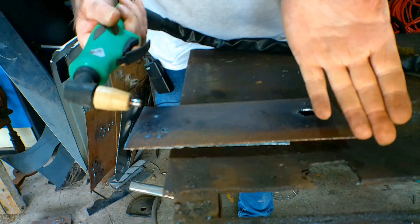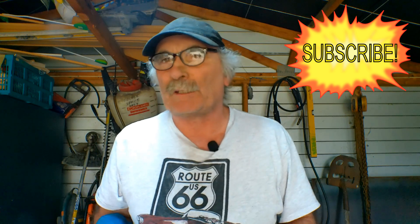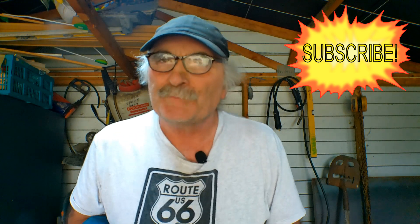That's basically Pete's lecture for the day! So guys, that's how I ended up buggering most of my tips — I didn't know what I was doing, I didn't drill a hole and I didn't cut from the edge. I just barged straight into it thinking it says on the tin it can cut half an inch so I'm going to cut three quarters of an inch. It's a learning curve anyway guys — if you're going to cut thick stuff, drill a hole in it first. Quite easy. Save yourself some money, save yourself some frustration. Anyway guys, same as usual — like my videos, subscribe, drop me a like, drop me a comment. Come say g'day in the comments below and we'll see you next time!